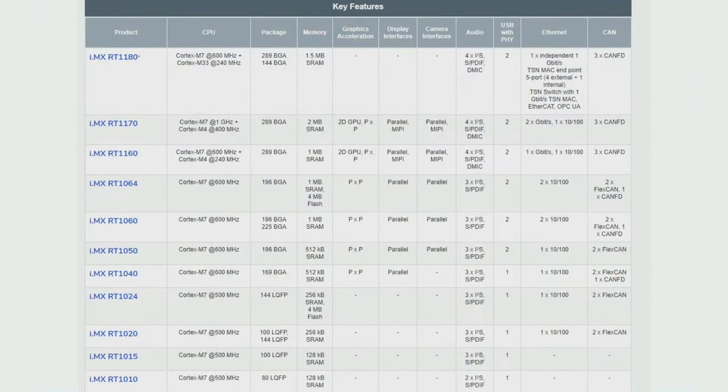This is part of the IMX-RT chip series. The numbering is a little confusing — the RT-1010 only has the 1011 in existence; the 1040 family is actually the 1042. Starting from the bottom: the RT-1011 doesn't have Ethernet or CAN, only one USB, and no graphics. The 1020 doubles RAM to 256K. The 1040 doubles it again to 512K, and it's the first one to move from a QFP or QFN to a BGA at 0.8mm — manageable for any pick-and-place house. It has graphics acceleration, lots of I2S and SPDIF, and notably two FlexIO peripherals, whereas the 1050 only has one.